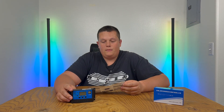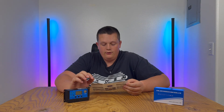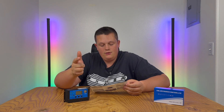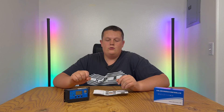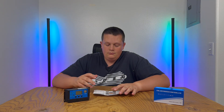When you power this up to your battery, there are six menu screens. The first is the main display. The second is the float voltage — that's the voltage you want to set to keep your battery maintained. This solar charge controller will do its best using the solar panel to maintain whatever float voltage you set, and in the menu it defaults to 13.7 volts for float.